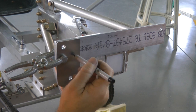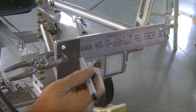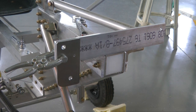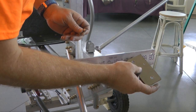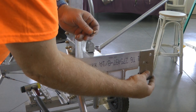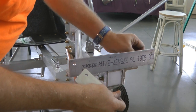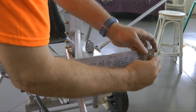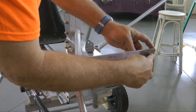Mark the hole, punch it, and drill it all the way through. We want this to be a 3/16" hole for a small 3/16" bolt to hold the plate permanently to the angle. Here's the front nose and our angle is in place. These plates we made will bolt on right here. This bolt is for an AN3 — put it through the front of the angle and then a nut. I'm going to use a temporary nut for now, and the other holes are for the ring mount.